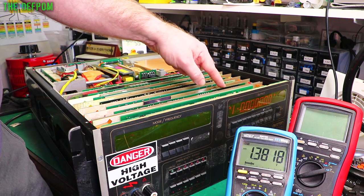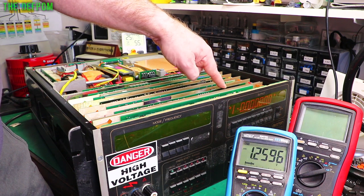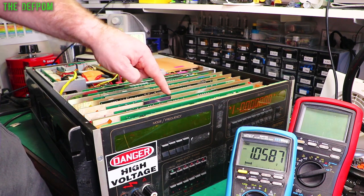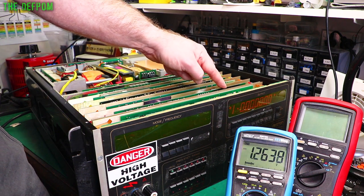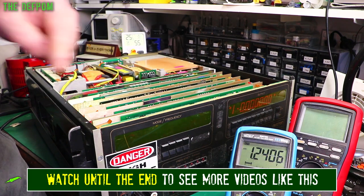There's something going on here with this board where there's obviously a bad connection somewhere. Now, I don't think it's on the logic board, on the main motherboard, because if I push somewhere else to move that board around, nothing happens. It's only this board here, if I'm flexing it slightly. I haven't figured out exactly where it is, but there's definitely a connection problem there. So I might have to go around and resolder all the joints on this board.